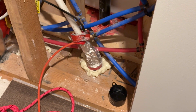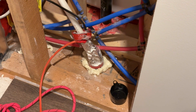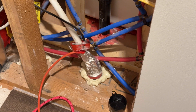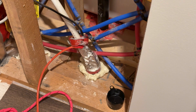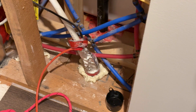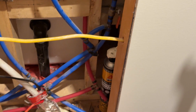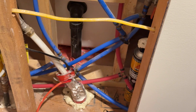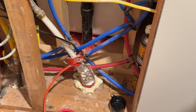Now we're inside, right above that culvert, which connects up underneath the floor. I have a two-inch pipe coming all the way from underground up to this level, then a white three-quarter-inch PEX line through that so I could shove some heat trace down there. I was hoping interior wood heat would keep that line from freezing too. That comes up to my future filtration area, then over to this spaghetti of PEX piping that tees off to my hot water tank.